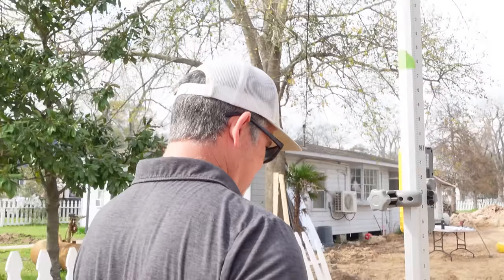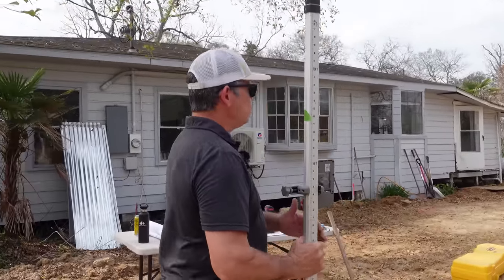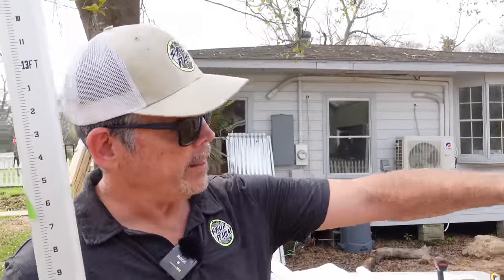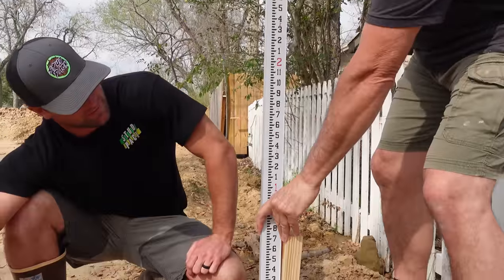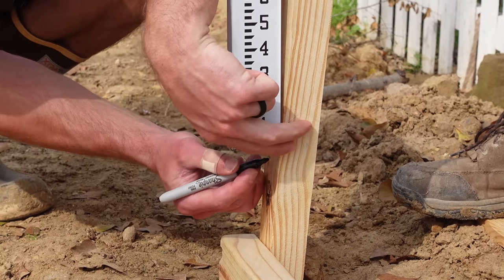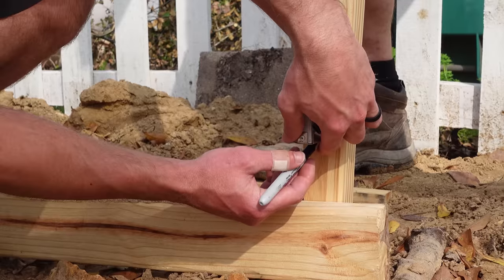When we bring the rod back up, the bottom of the stick will represent nine inches above the sidewalk, and we can use that to set all the batter boards perfectly flat at that elevation. Nine inches isn't a magic number — it's just what we're working with; we think nine inches over the length of the driveway gives us nice drainage. The plans say the slab should be 12 inches higher than the surrounding grade, and we know we're 12 inches higher than everything around us from all the select fill we brought in. I'm gonna hold this rod plumb and Rad's going to mark the bottom — that mark is the top of our slab, nine inches above the sidewalk.